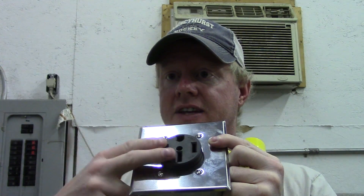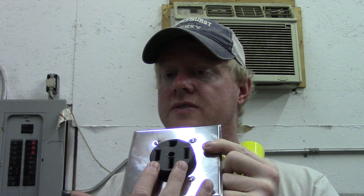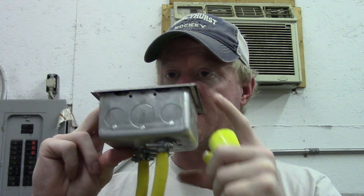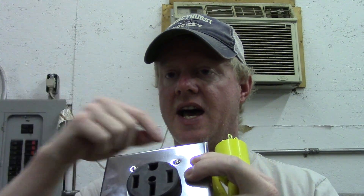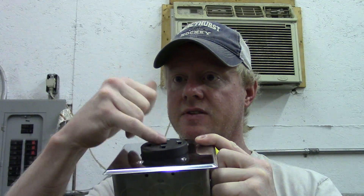This particular cable is a 50-amp to two 15-amp. A lot of people have questions about this — everything in my RV is 110. Basically inside this cable, everything is tied together and the two hots are tied to the hot line of the 50-amp plug. That's where I'm actually able to supply somewhere around 30 amps to this 50-amp plug, which will run everything in my RV.